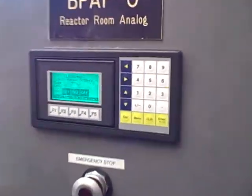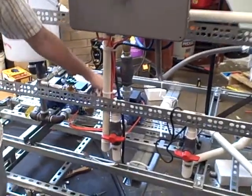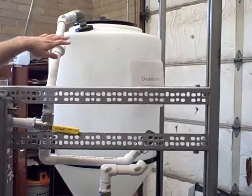They can go off of this, and what it's doing is it's circulating the liquid through this circulator pump here. The loop that it's going to follow is out of this big tank, it's going to come out these pipes down here, through this circulator pump, into this heater, and back inside to this tank.